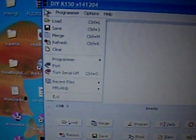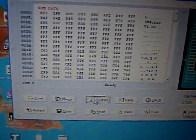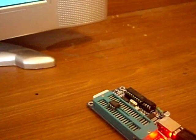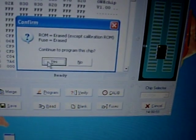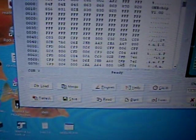Back in our flashing program, we click File and Load. We're going to load the one-chip dot hex on the desktop, so just double click that. It loads the code which you can see there. Now we just click Program, click Yes. It's going to say ROM erased, fuse erased, continue the program with chip — and we'll say yes. You'll see it write into the chip — you see the program flashing, that means it's written. Programming complete. We'll just read it back and you can see the one chip. We click Verify and it says data verified. So that's our PIC chip programmed and we'll go back to the PS1 and solder it in.